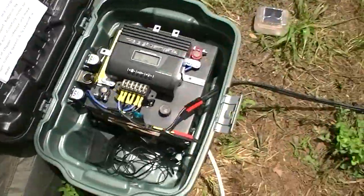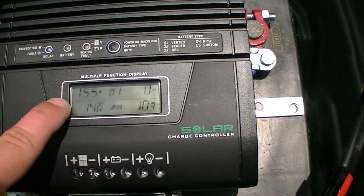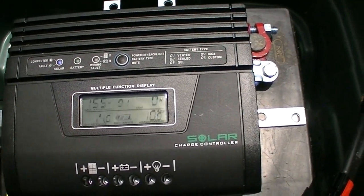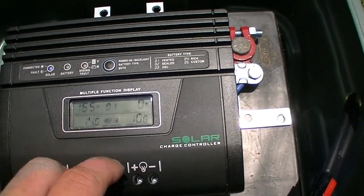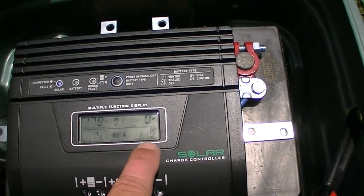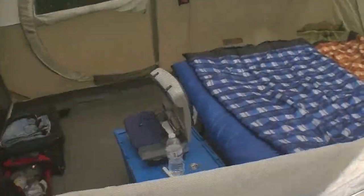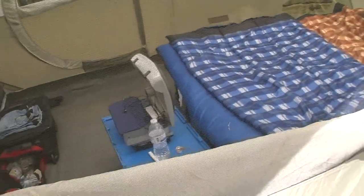Here's the box I showed in the other video earlier. You can see at the moment we're getting about 144 to 150 watts depending on how much cloud cover there is. The battery is actually almost charged — it's about 95%. It has to hit 14.4 volts before it's fully charged. That's how much amperage the panel is putting in. We've been running the portable fridge freezer for the last two days, running the camping fan, and charging our cell phones. In the 48 hours we've probably never gone under 80% charge.